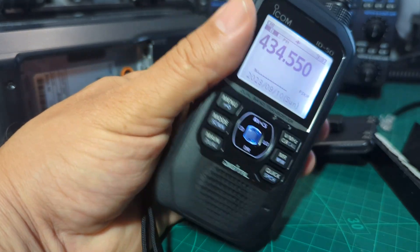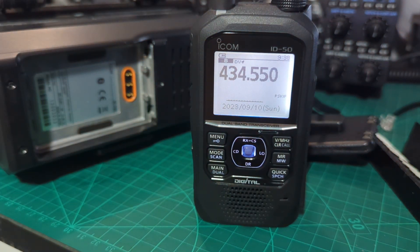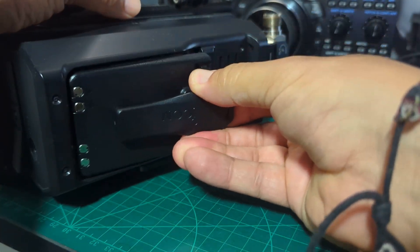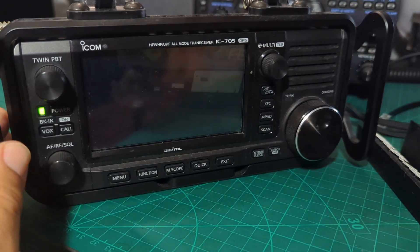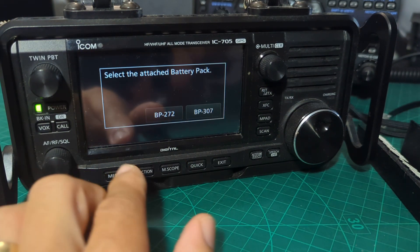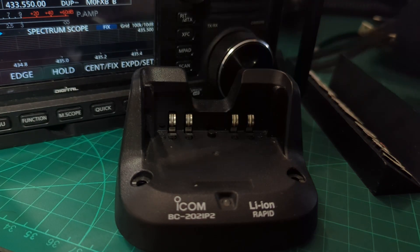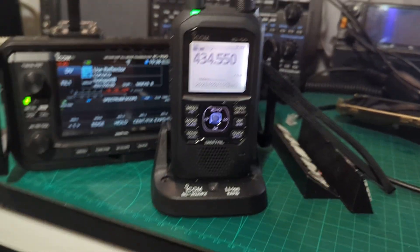If you've got an FT5 you can get big super batteries for those now too — similar kind of thing, well worth it for the FT3, FT5, and probably FT1 as well. Then with the smaller battery — it's a bit small for the IC-705 but it will go in and clip in there. When you turn on, it normally asks which battery you're using: BP-272 or BP-307. In this case select BP-272. They all fit in the cradle charger — with the super battery it goes in there nicely.